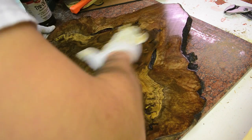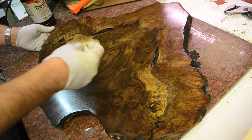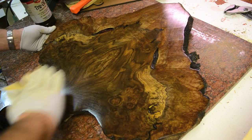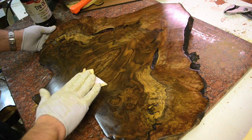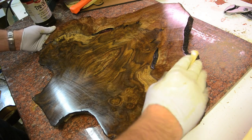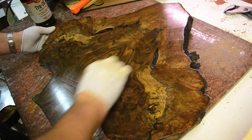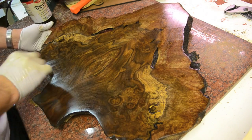When I get to the very last bit of wiping, when I know it's pretty much in, I do some really big strokes and really light strokes to make sure I don't get any fine lines in the wood. So I'll find a spot, do some real light wipes, and that's it.